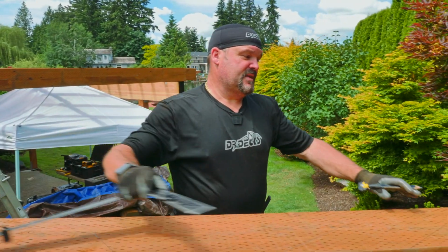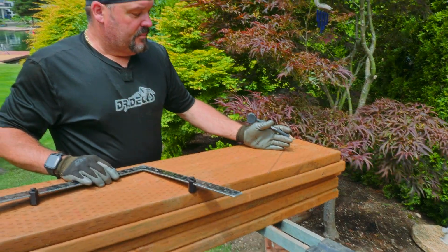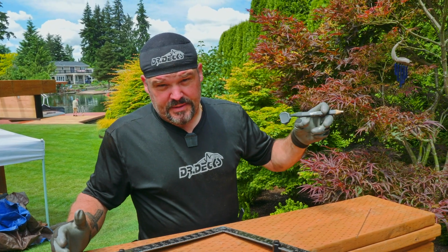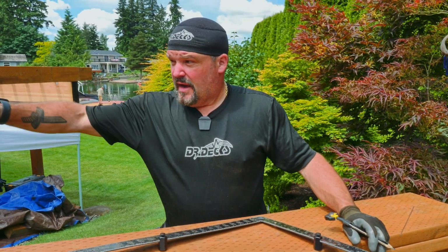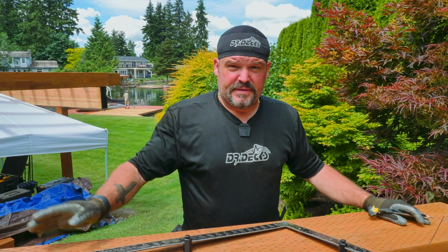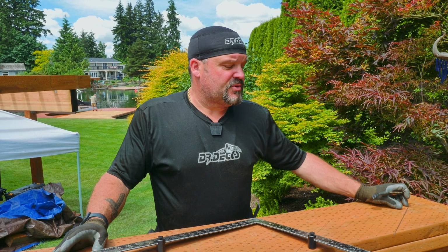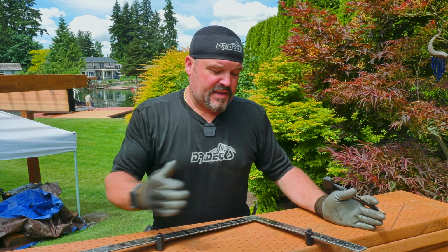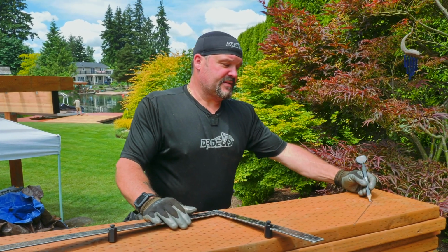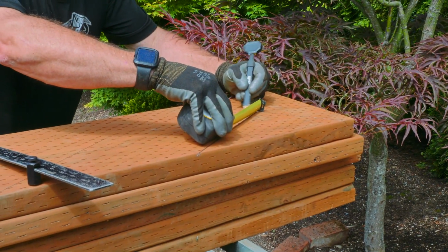But my top step, I have to subtract material from the back side of the stair, because if I don't, it's gonna make the stair jack too thick and I'll have 2 deck boards plus a rip piece. Now, because of the way I'm building my stairs, I've already set up support for it on the deck. So I don't have to worry about subtracting for the thickness of that, because it's gonna tuck right underneath there. So I don't have to subtract 1.5 inches for that, but I do have to subtract 1.5 inches for the fact that I'm adding 1.5 inches to the face of each one of these stairs. So because of that, I'm gonna subtract an additional 1.5 inches off the back side of my staircase, like so. But just off the back step of the one stair.